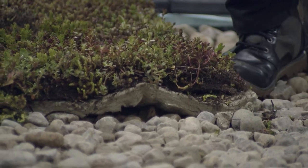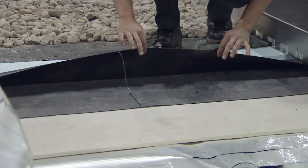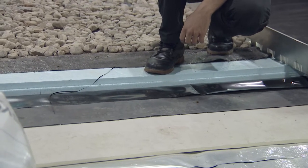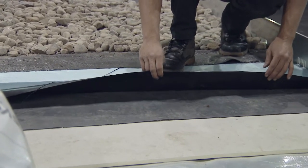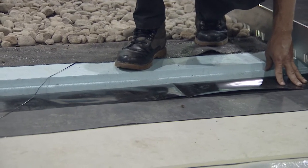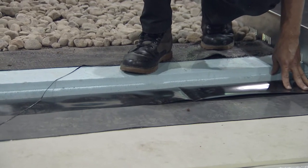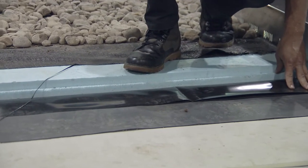Starting at the bottom of the roofing assembly with the root barrier: this black layer does essentially the same thing as the blue plastic layer in the previous demo. Before the insulation is installed, the root barrier must be laid in an inverted roofing assembly. It is 20 mil thick, made of low-density polyethylene, and comes in large rolls — 13 feet wide and 82 feet long — to minimize the number of seams on a roof. It's flexible even at low temperatures. The root barrier is installed parapet to parapet, overlapped 12 inches, and not typically sealed, since the plants have very shallow roots.